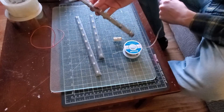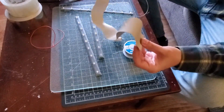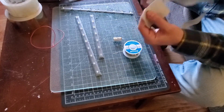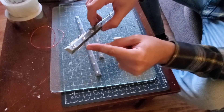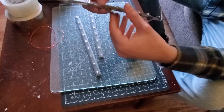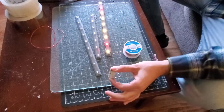I soldered up the first light strip. Pretty much what I'm using is some old ribbon cable from a Packard Bell ancient desktop from around 1995. I'm ripping off one piece at a time and soldering all the way up — I'm actually melting off the outside plastic on each one because stripping it would just be too tedious. It does work. Let's see if this works — I'm pretty sure this should be negative and this side positive. And there it is.